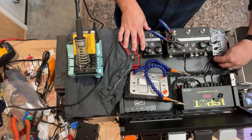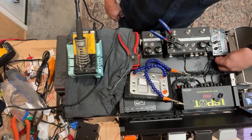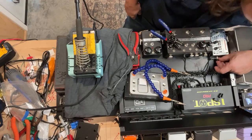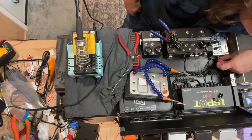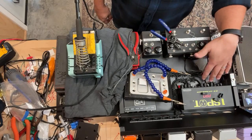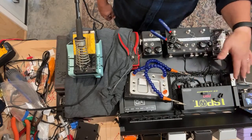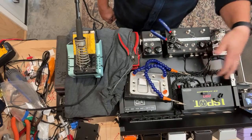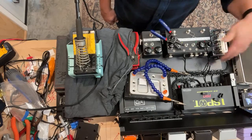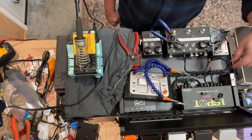And again, I'm using the molded side of the plug, so this is the side that, just as it comes from the manufacturer, stays on the pedals, because these are more likely to take abuse on the pedals themselves. I think the molded end tends to be a little more robust than the newly soldered end, where we're putting the zip tie against it. Because in this position, especially with the riser, this is going to come down on it, this is not really going to be touched. Nobody's going to be manipulating this generally or tugging on it. It's the pedals themselves that are going to be subjected to the most wear and tear. So the molded end I usually keep there. I've seen people do the reverse of this, but I don't think that it's the best way to do it. I think that this is the best format.